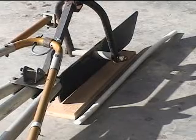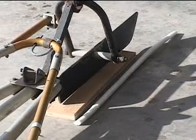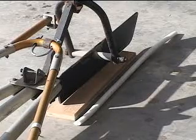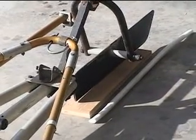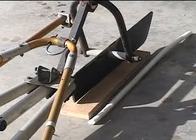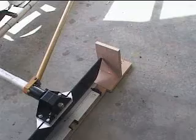What you'll also need to do is raise the front runner the same height as the rear. You'll also need to throw some weight in the boat to simulate sailing conditions and to deflect the plank if it's got a bendy plank, because that will throw off your alignment too.